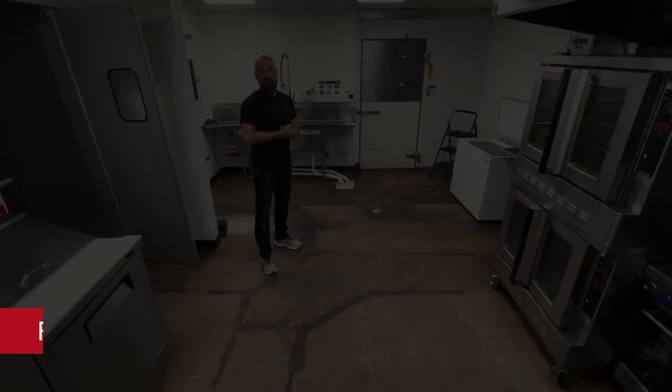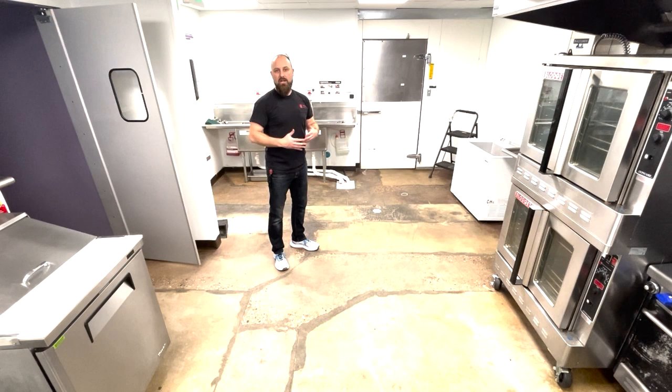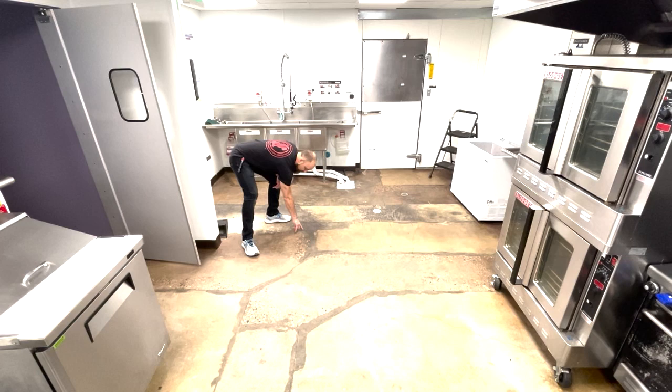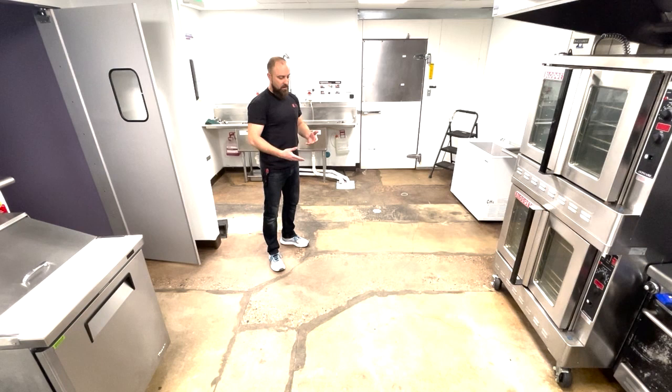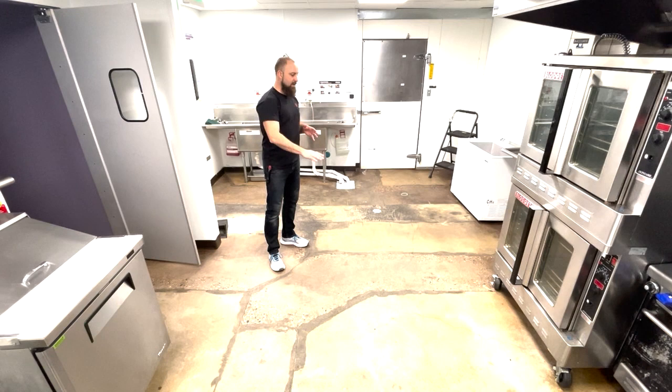Finally, we'll talk about the floor covering. Here we don't have covering so much as a concrete slab. Having interviewed the owner earlier today, we learned that all the cutting visible on the floor is from extensive plumbing work done to open this location. When looking at commercial kitchen flooring, ask yourself: is this flooring safe for employees? Is this concrete a non-slip surface? When the kitchen is steamy and potentially greasy, this is not a safe surface. What should be installed wherever employees are working would be rubber mats, which need to be picked up and cleaned nightly along with the floor underneath.